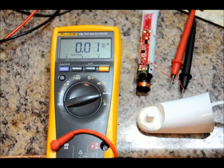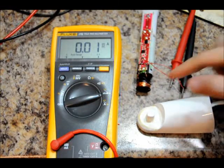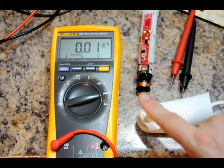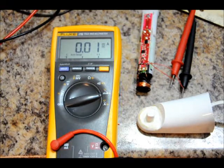To reverse engineer the circuit is very, very easy. Some of these toothbrushes have a center tap on the receiver coil, but this specific one doesn't — it just has two coils. One goes to the negative, one goes to the rectification and filtering section. I'm essentially causing the short circuit, as explained before, to pull as much as I possibly can from the transmitter.